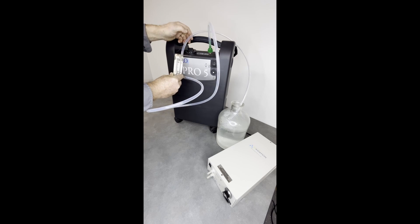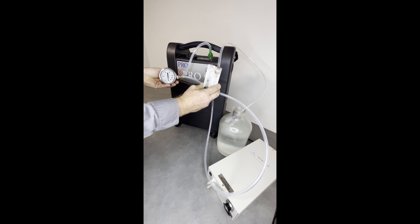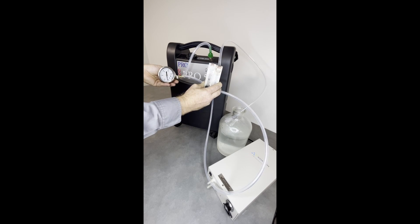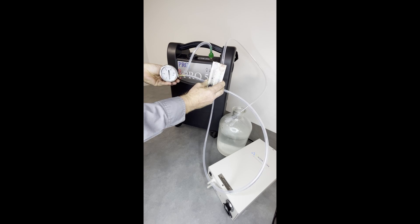I'm going to show you what happens when you put some back pressure on there. I have things set up here — this is dialed into five liters a minute. I have two flow meters: one goes from zero to ten, the other from zero to five. They're showing about four liters a minute because I've got one PSI of back pressure indicated on this gauge here, so it doesn't take a whole lot of pressure to reduce your flow rate.